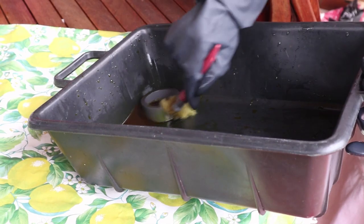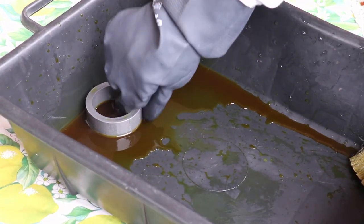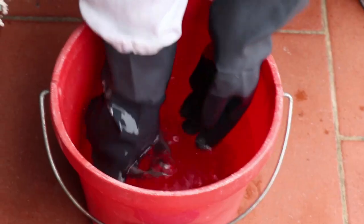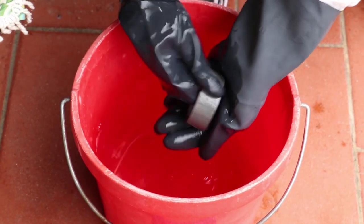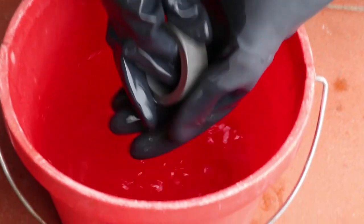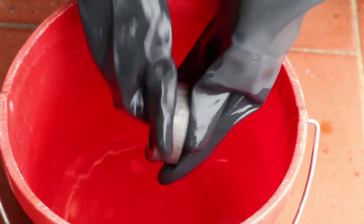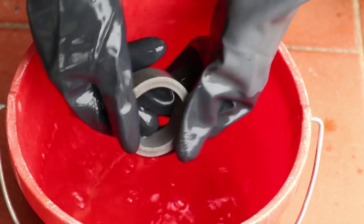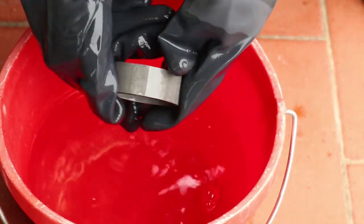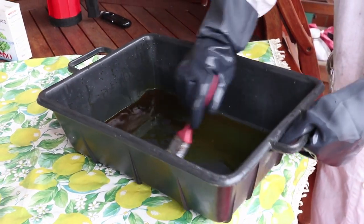In a matter of a few minutes the part is free from any scale, so I brought it into the bucket full of water to rinse and neutralize the part. After a final rinse in clear water, the metal must be dried very well because now it is really sensitive to oxidation. If you don't dry the metal quickly, a thin layer of orange ferric hydroxide forms — that is the code name for rust.